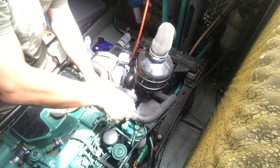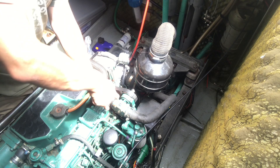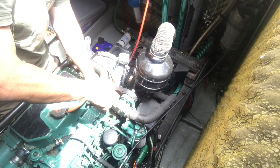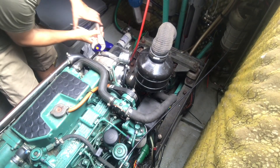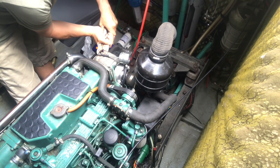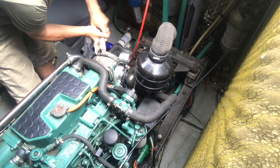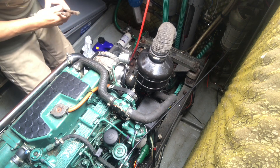It might not be strictly necessary on that side, but I've definitely found that if I don't put enough water on that side — especially when the seacock's been on and off a few times — it doesn't actually suck through. While I'm down here I just want to check the wastegate for the turbo, just make sure that's free. It's nice and free — sounds good.